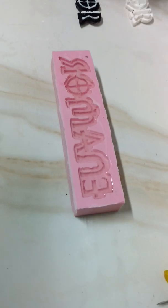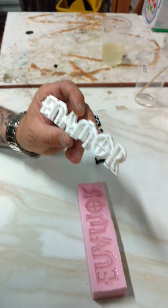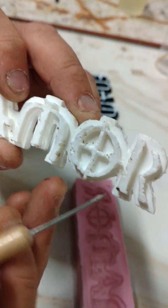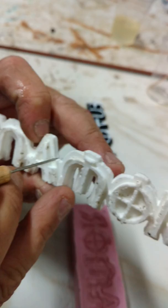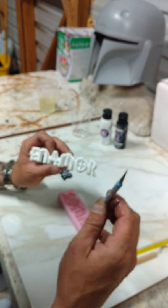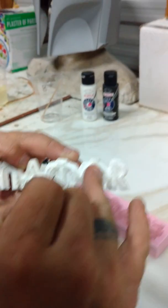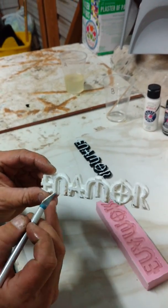When I pull this out, this is what you're going to get — you're going to get this plug right here, this cast. You're going to notice it's going to have to be cleaned up as you pour these things. If you get close on the camera, Fatima, you can see how the edges are kind of jagged here, and the eyes are a little crooked — you're going to have to clean some of this out. You see these little things that end up sticking in the mold. I usually use just a little X-Acto knife or a Dremel and just come in and clean them out, smooth them down, take a little sandpaper, clean everything out. You'll also have to even some of this out.